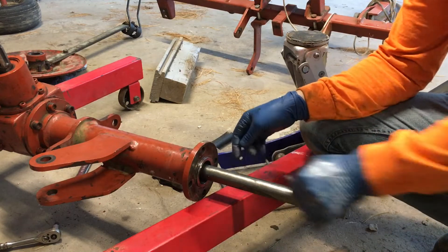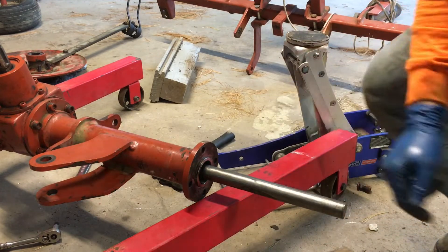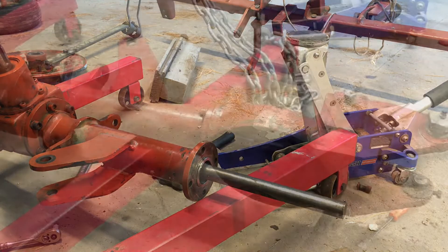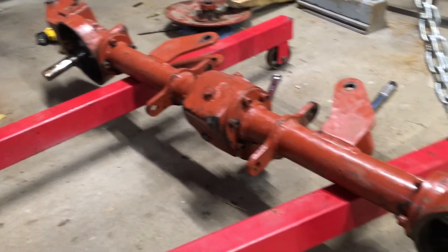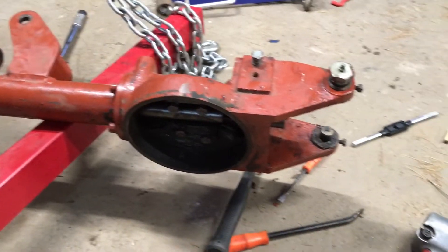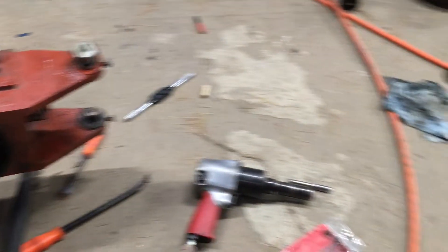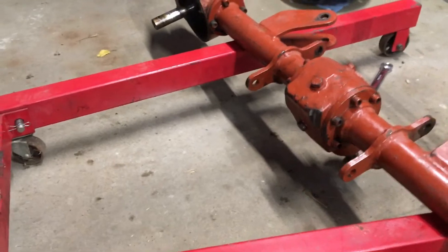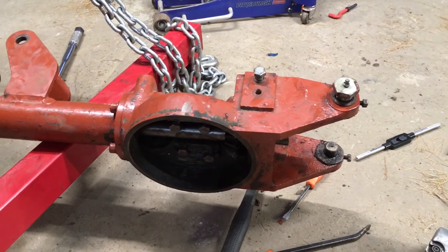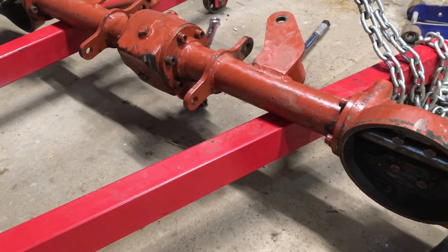Don't have her put all back together again. We made our mark so we know how to line the hats up. We're about two hours in and we've got everything tightened up and put back together again. So now we're just ready to do the final assembly — we just got to put that yoke back on there and put the hats back on each side. They just slide on and we'll make sure our lines line up that we put on the housing, then bolt her all back down. This is going pretty good, and that new helicoil I put in there worked super slick — I got it nice and tight.